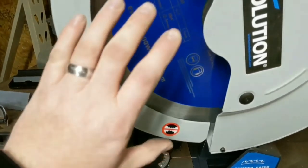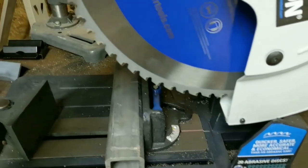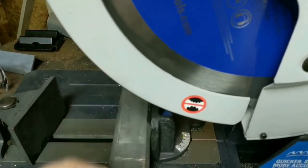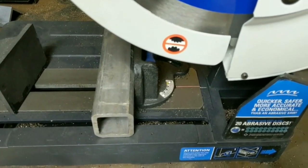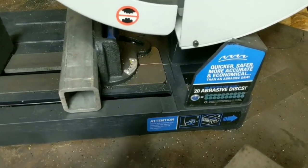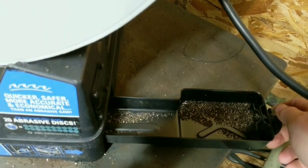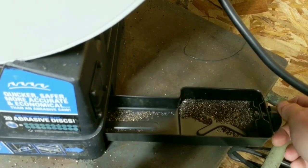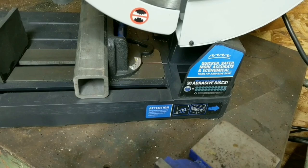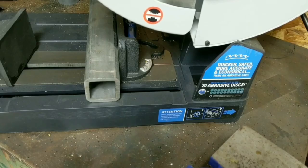Your typical cutoff discs that you used to buy on a metal chop saw would kind of throw metal everywhere. This particular unit just has a regular teeth-style saw blade, which works really well. It has really good control at directing where those little bits and pieces go after the cut. There's a tray in the bottom that works really well — you can see I've done quite a few cuts and it's collected most of the scrap metal. It probably collects maybe 90% of it, and a good 10% does kind of come off and coat your work area, but it's still pretty nice to catch most of it.